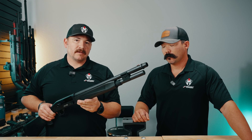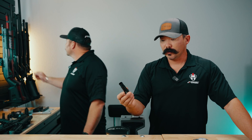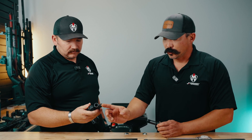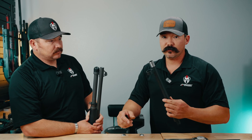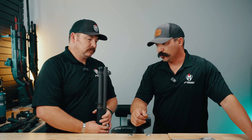Other things to consider when sending in your shotgun: is your barrel chrome-lined? If it's chrome-lined, you're out of luck for doing the internal choke. Some guys out there have been rumored to do chrome-lined barrels, but we aren't willing to ruin our tooling trying to cut through chrome. This is another instance where external threading is a fantastic option — if it's chrome-lined, we can put an external thread on it. This Benelli here is another instance we're currently working on a solution for.